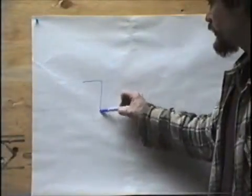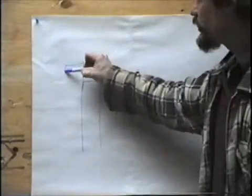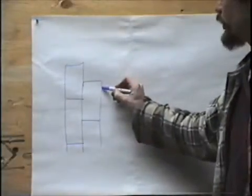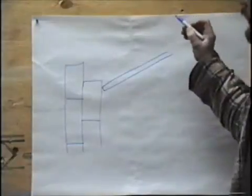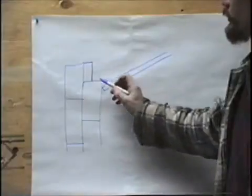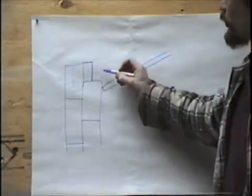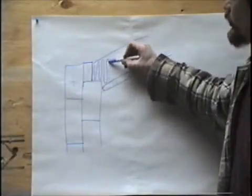So if this is the K-26 brick, and this is the K-23 brick behind it, then I'm going to put a piece of plywood in here. I'm also going to put another piece of K-23 brick right here, which will basically be a quarter brick. And then the crown will be this area in here — this will be the crown casting.